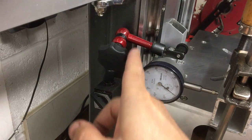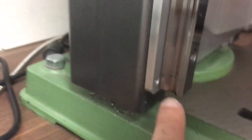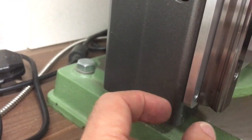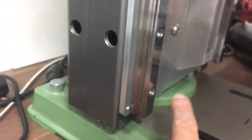I've got the DTI magnetic base onto the steel box section, with the little arms coming forward onto the box section that's clamped on. As I do up one of the M5 screws it'll push through this plate and bear against the box section. If I overdo it, it'll start to push the rail away and I should see a reading on the DTI. So I'll tighten it up, lock it in place, and get some torque onto the screws already in there so everything is locked in place and should stay there throughout its life.